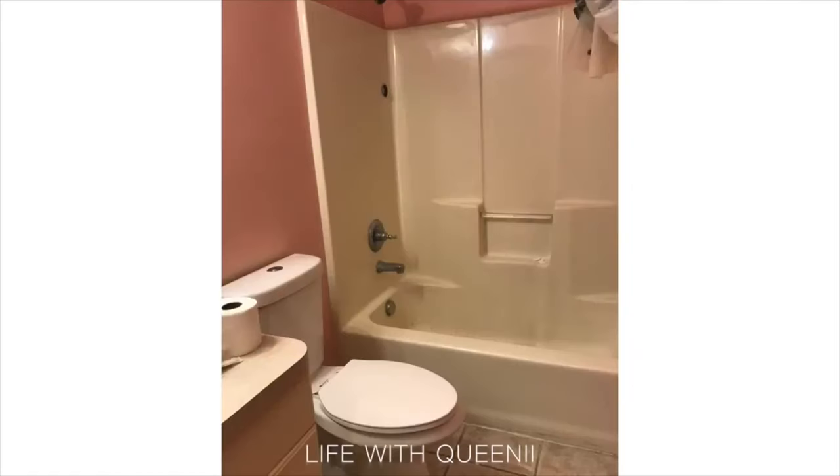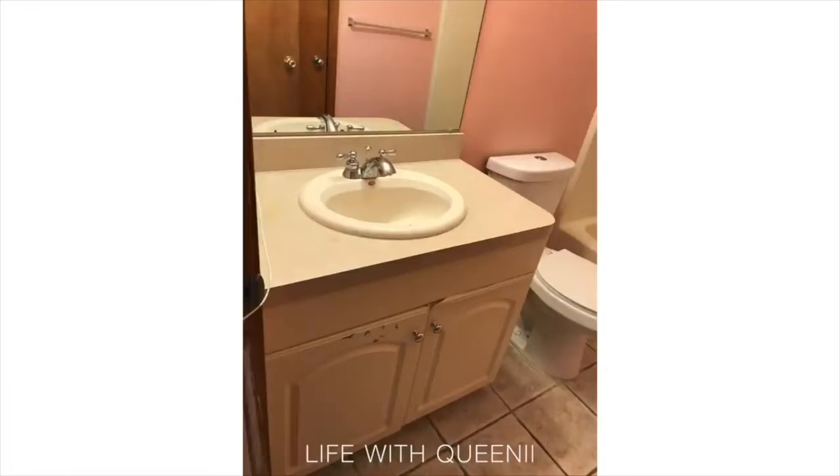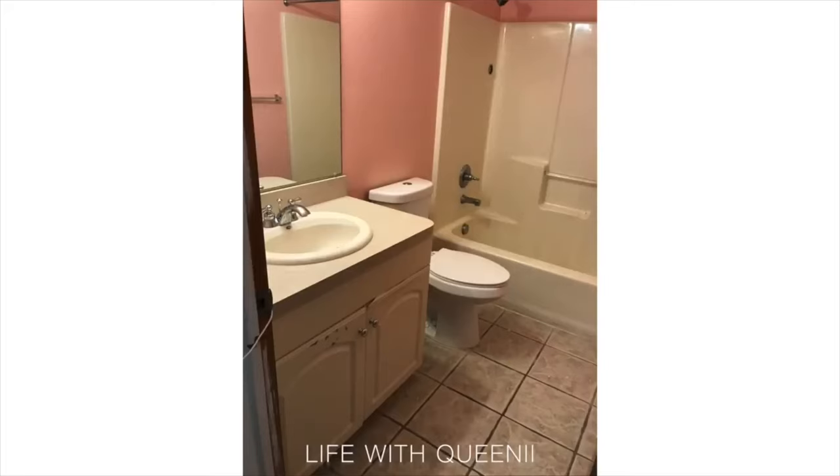If you're interested in that makeover video, the link is down below — it was a pretty affordable makeover. All you need is a hammer — not a fancy one, a dollar store hammer works — and cheap pliers. Create resistance in the drain, turn counterclockwise, and you'll get the drain out. You can even use pliers on a drain that still has its thread, so you don't need a fancy drain-removing tool. But if you want to buy one, go ahead! Love you guys, thank you for watching.